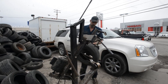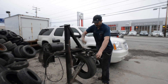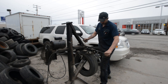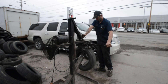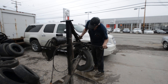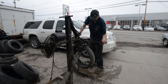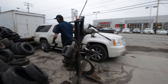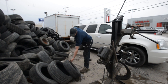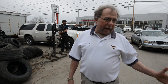We built a few roads at the new power plant out at Fort Martin. We built three blacktop roads, one cement road, and one gravel road out there. The gravel road leads to a weigh station where they have 300 loaded coal trucks a day that they weigh. Since we put that road in, the plant manager told us his maintenance has gone down 75%, so he's saving on the back end of it too.